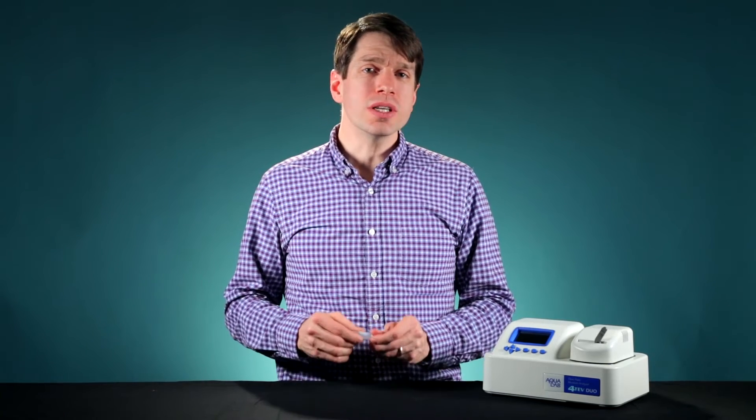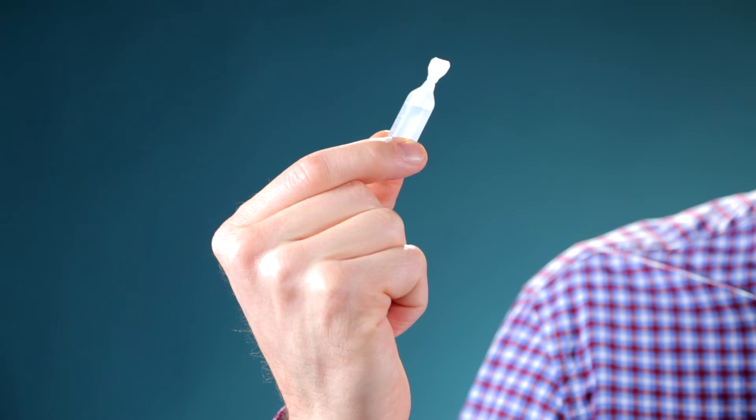A few things about your water activity reading. First, you don't need to understand the science behind water activity to use the power of the reading. Second, if you want to compare water activity readings at one factory to another factory, that works great too. All you need to do is make sure each instrument is calibrated properly and verify that using a simple salt solution. To sum up, water activity is a simple but powerful tool to make sure that your products are safe and profitable.